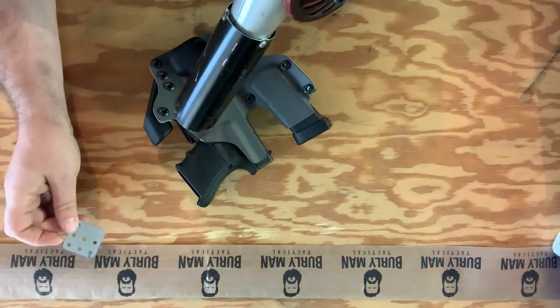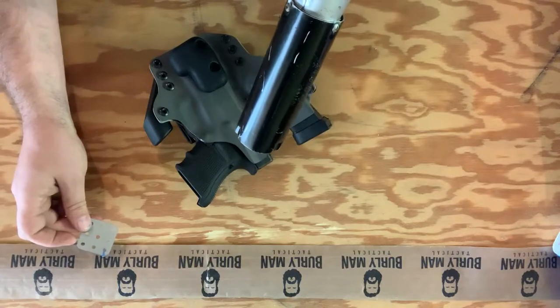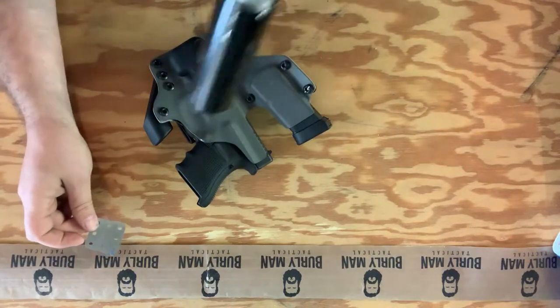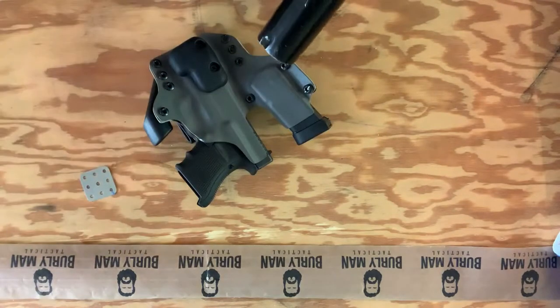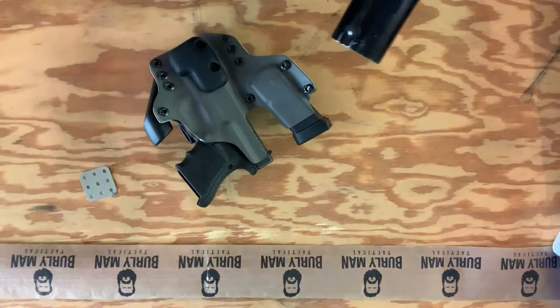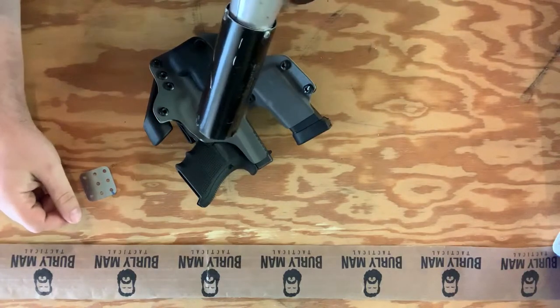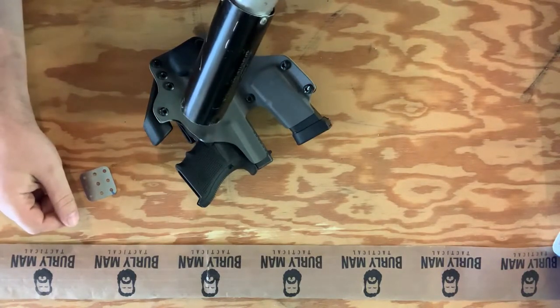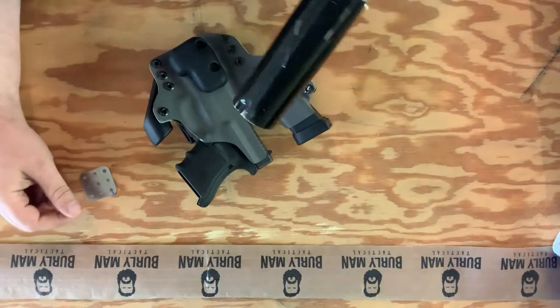This is something that should definitely be approached slowly and meticulously at first, rather than just putting on a ton of heat and trying to do this in one step. It is much better to apply a little heat and keep testing it than to leave it on too long and scorch the plastic. With more experience you can do it quickly, but at first, please approach this process with caution.